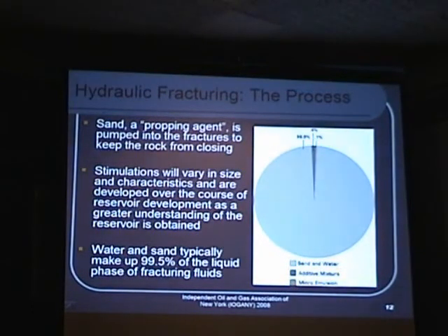The video talked a little bit about the agents that are used during the fracking process. Sand is the propping agent. If you split rock at those pressures and that far down, when you fracture the formation, if you don't use a propping agent, that will close back up.